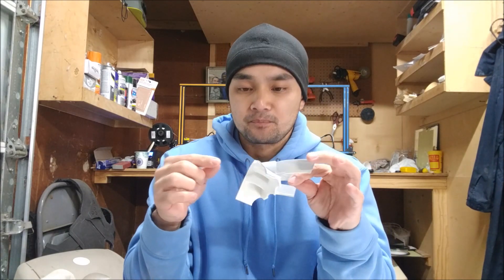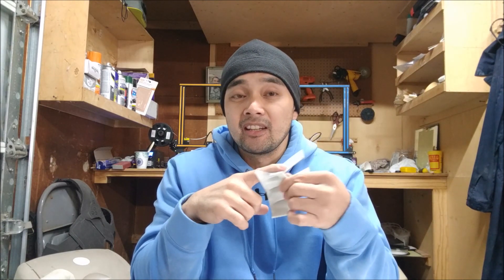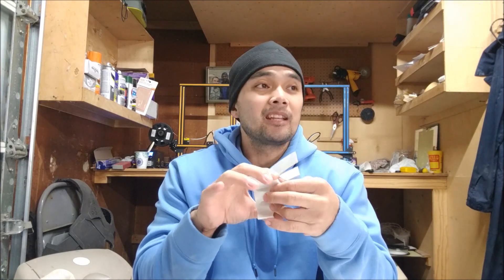Also, PLA doesn't like moisture. What resin does is it protects your prints from moisture in the air. It also has adhesive properties, so when you glue things together it helps create a stronger bond. And third, it fills in everything perfectly — it just makes life so much easier than sitting there sanding and using Bondo spot putty, which we're also going to be using by the way. XTC 3D is $30 for the big one; fiberglass resin is about $11 to $15 for twice the amount. It really comes down to preference.